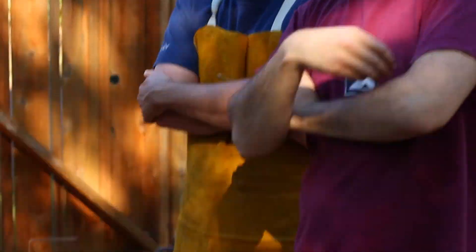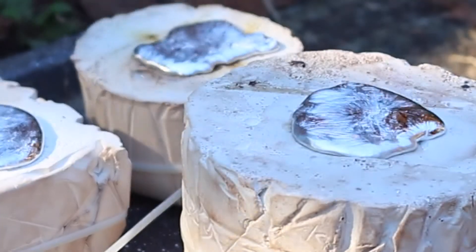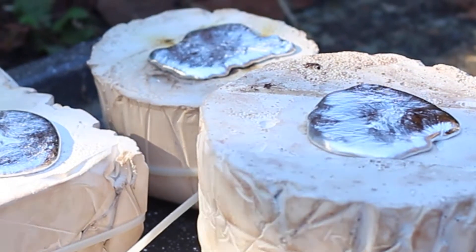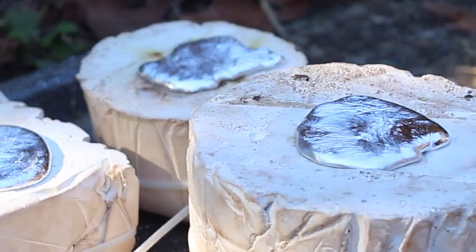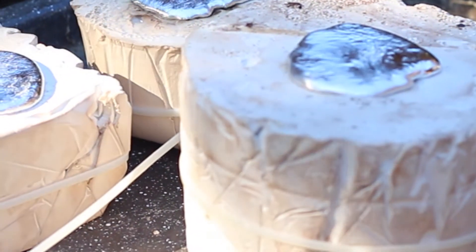So you can see the carbon leftovers are burning under the aluminum there and probably bubbling. So that one I expect to come out much nicer. The shellac that was left over that didn't melt out properly left a sort of carbon crisp, which is what is burning right now. I think that's going to come out worse — it's going to make CO2, and the CO2 is going to bubble into it and affect the surface. Whereas this one was done without the shellac and as you can see it's completely inert.